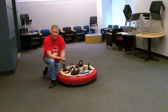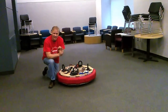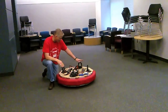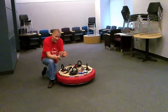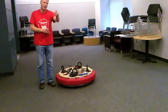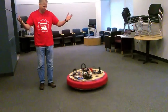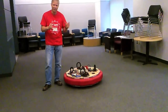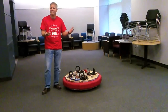Mobility was definitely one of the things we wanted to get out of this fall project. We also wanted to be difficult to pin and easy to get out of jams. We have on here a NAV6 - you can Google that - it's made by a FIRST team out of Hawaii. It's essentially a pointing-north device: whatever direction it wakes up in, it tries to keep track of that direction as you rotate. Paul is just pulling the joystick towards him and it goes that way. Now push the joystick towards me - magic. The gyro is keeping track of that using some really fantastic, literal rocket science sort of stuff, all in a nice package. We have some issues we're working through, but that's why you do it in the fall project instead of during the first season.